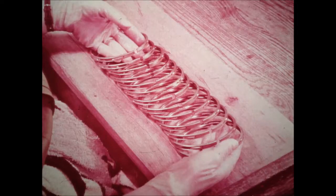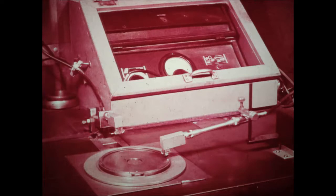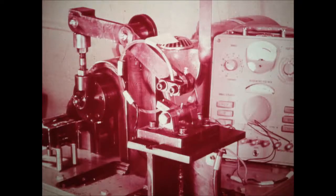Every operation on IH pistons, rings, and sleeves is checked by trained inspectors to ensure perfect sets of parts, according to absolute standards. Here is the test to determine the tension in a ring. A typical IH oil ring, for example, is inspected at 22 points during casting, counterboring, gap milling, and other machining operations. For example, here, a ring is subjected to hours of high-speed flexing.